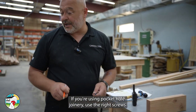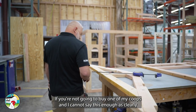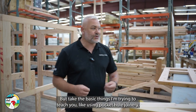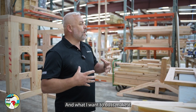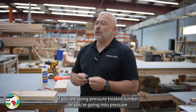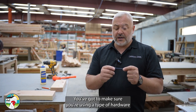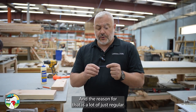If you're not going to buy one of my coops, I can't say this clearly enough: get out there and build your own coop, but take the basic things I'm trying to teach you — like using pocket hole joinery. A lot of people have never done construction before and I want to make it so you guys can understand what you need to be successful. If you are using pressure treated lumber, you've got to make sure you're not cheating yourself with cheap hardware — you need hardware that is meant to go into pressure treated lumber.